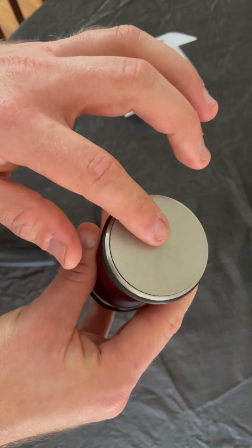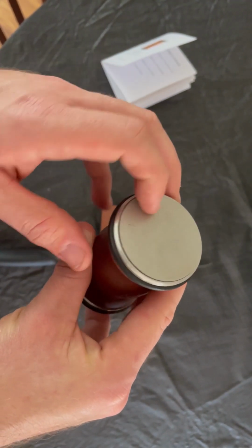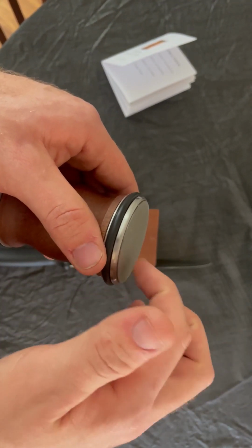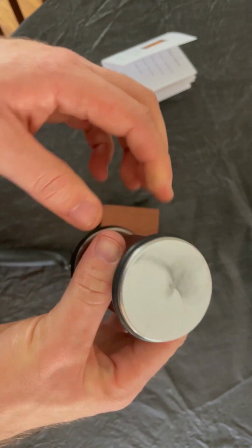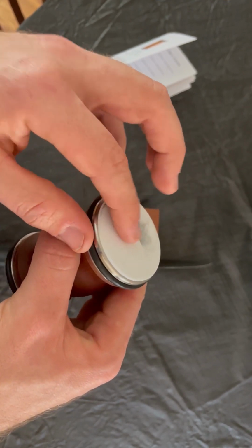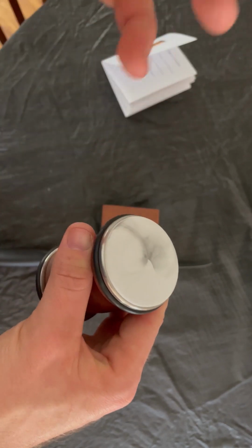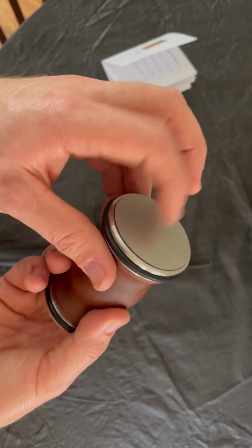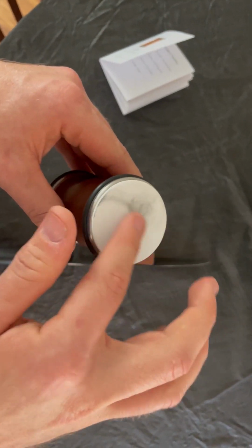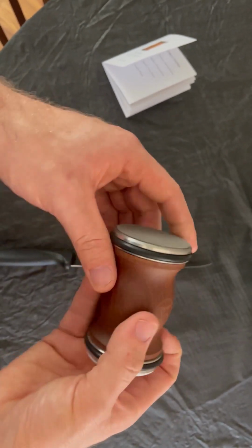The one side, which is more of the rougher feel, and it's also gray, that is what you start with. That is the diamond grit, I guess is the best way to put it. This is what's really going to do the sharpening. Once you do that, then you just pass over a few times with the ceramic side. What this basically does is smooth out the sharpening and get some of the burrs and different things off of it, the little pieces of metal.